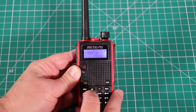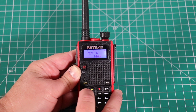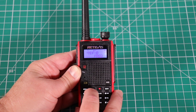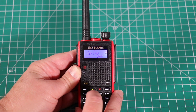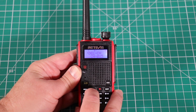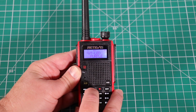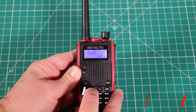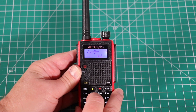You can choose how you want the display to show — frequency, channel number, or name. We'll do name for channel A and frequency for channel B. That gives you your shift for the repeater, positive or negative, and where you put in your offset frequency. You can delete a channel at menu item 28. This changes the color of the LED for receive, transmit, or standby. It shows your band, Roger beep on or off, and menu item 40 is how you reset the whole radio.